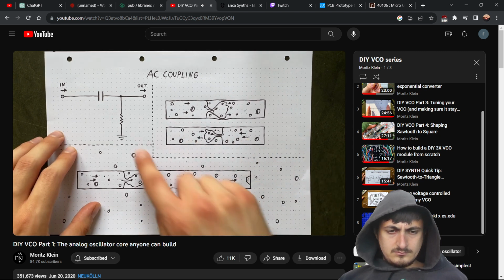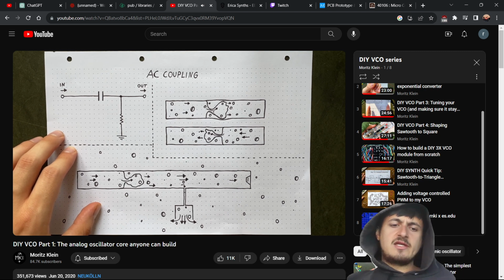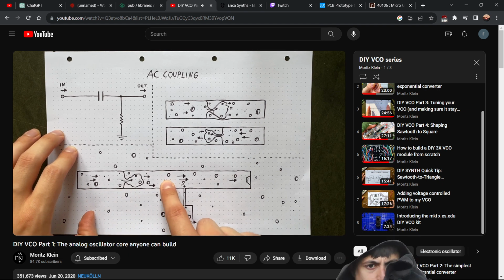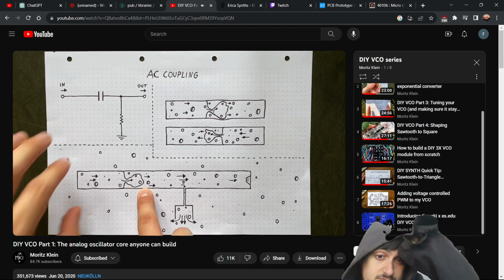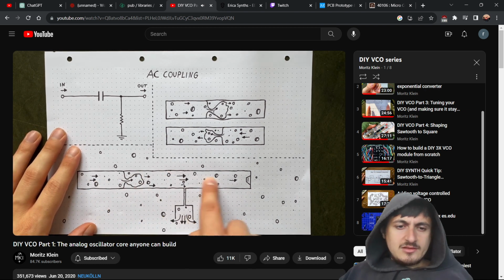Next, we'll have to bring in our resistor after the coupling point, going straight to ground. This acts like a kind of equalizing valve, and that's how we knock out the outside voltage. Because now imagine we apply a steady 5 volts from this side. Then on this side, we'll read 0 volts after a short amount of time. Why? Well, we're pushing water into the balloon with a constant force from here. The balloon is stretching into this pipe, pushing water in this direction.